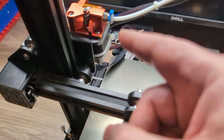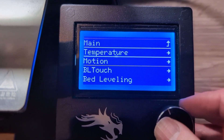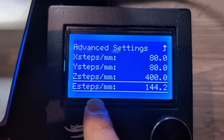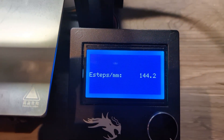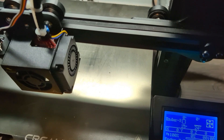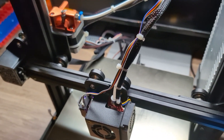If you have a dual gear extruder like I do, you need to adjust the E-steps in the settings. Go under Control, then under Motion, then under Steps. The original value is 93 or 94, but if you have a dual gear you need to increase that. My E-steps is 144.2, so you might need to adjust to that. Check the user manual for the product you purchased — if it's similar to mine, you probably need 144, but it might differ. That's how you adjust the E-steps for the dual gear extruder. Thank you for watching; I will see you in the next one.